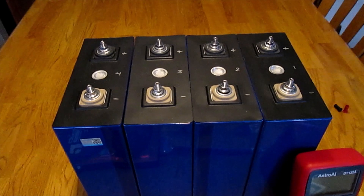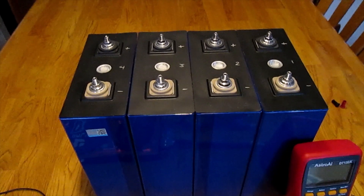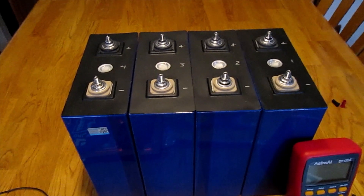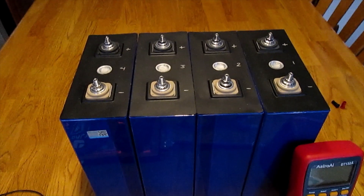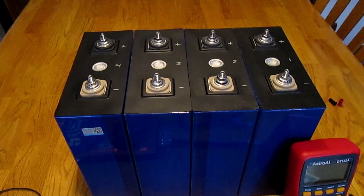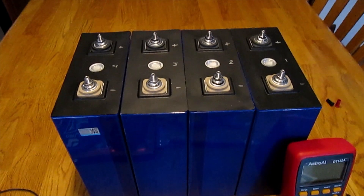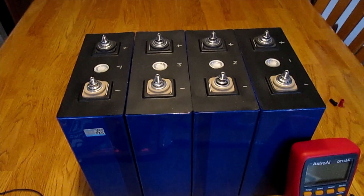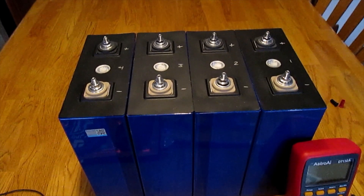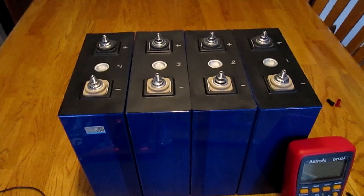The first step will be charging this battery in series to bring it up to approximately 14 volts. Next steps are top balancing. So far I'm relatively pleased — three out of four cells came in appearing to be in very good shape. Cell number four has a little bulging that concerns me and is higher in voltage upon delivery. We'll be monitoring that carefully as we top balance this pack and get ready for implementation within the solar power generator.